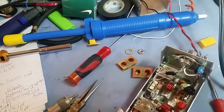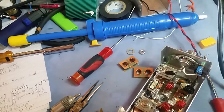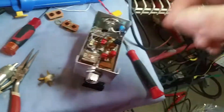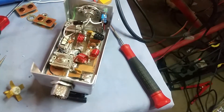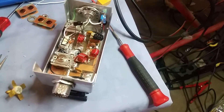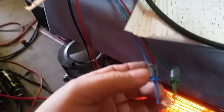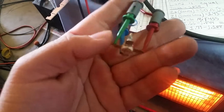Then I got to thinking - let me take a look at the transistor. Actually, before that, I said screw it and grabbed two transformers - I was going to just take the tuned circuit out and build a broadband one-pill like I normally would, because I know you want it working no matter what I have to do. But then I pulled the transistor and the transistor is damaged.